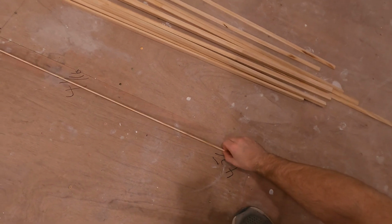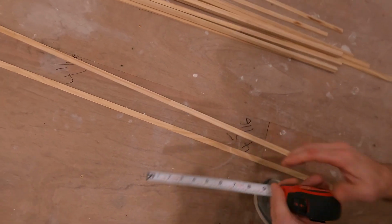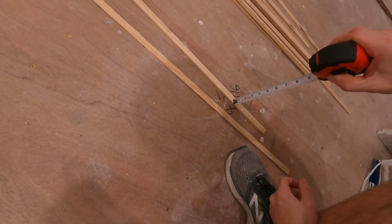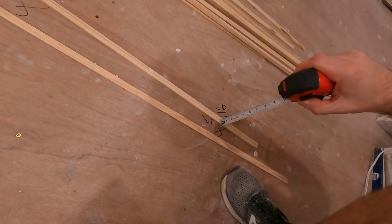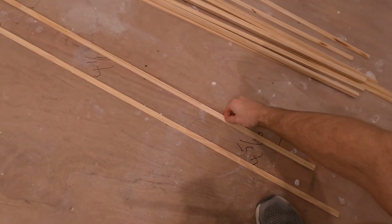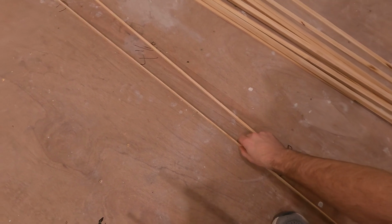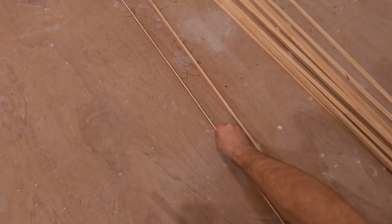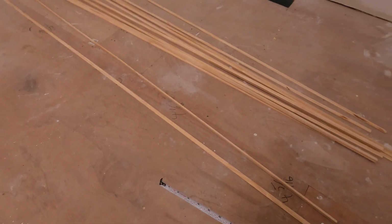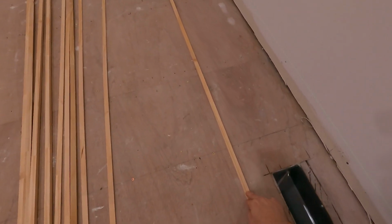So instead of the 1/8 inch thickness here, I would come along with the 1/4 inch thickness and put that in instead. And now I'm just about a 32nd to a 16th too high, and I'll be able to work that down with my planer. So I'll be using different thicknesses, and it's gonna look a little bit chunky and blocky until I can come along with my thickness planer and smooth everything out. The goal in the end is to have something right at 4 inches.